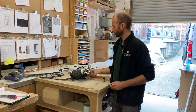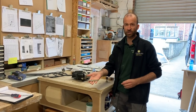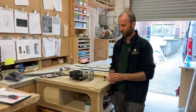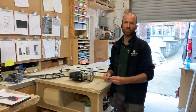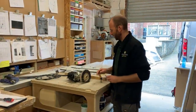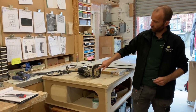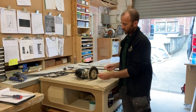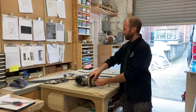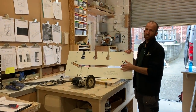half inch collet. That refers to the diameter of the shank of the router cutter. That's a half inch diameter. It so happens that for this process, the standard cutting diameter is also half inch, or 12.7 millimeters. That has to be fitted with a guide bush. So this is a removable bushing that, when the cutter's in there, acts as a spacer and a guide. So you can run it against the template, and that's 30 millimeters diameter, which is what this is designed for.